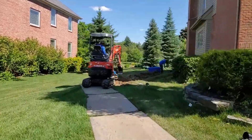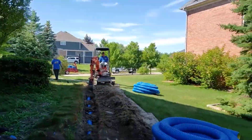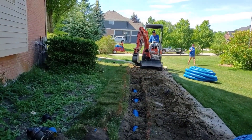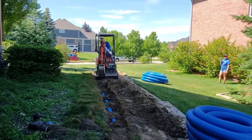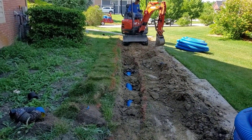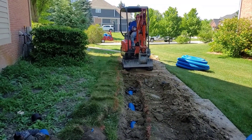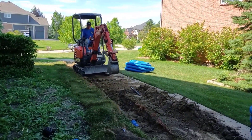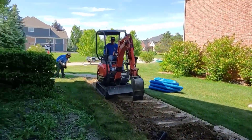So start here. This is where you start. And if you do have a bad area outside of your home and while you have an open trench, we've shown you before how we do combo systems — we'll have a solid pipe in there and a French drain pipe in there. These guys did a great job. You can see how they got dirt holding the pipe in place, so now you can take the machine and push the dirt over the pipe and not ruin the slope.